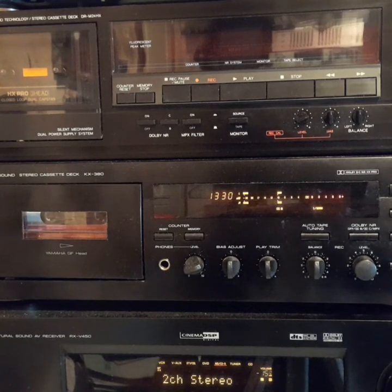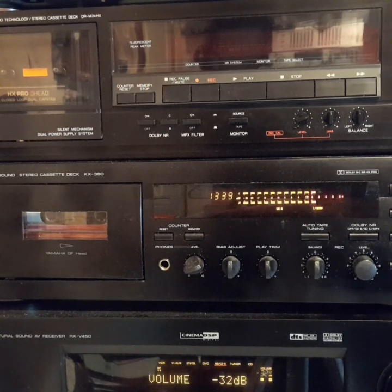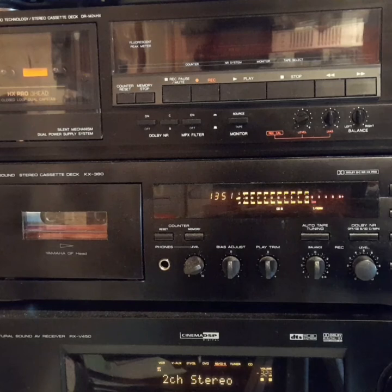You should now lower your volume control to normal. 7. Mechanical problems. If your deck is new and in good condition, you should not have any mechanical problems such as wow or flutter. But as the recorder gets older, the faults can creep up on you slowly and be difficult to recognize. We're going to provide some exaggerated examples of wow and flutter to help. The best way of detecting wow and flutter is with slow piano music, and we've recorded an example without any artificially induced problems.